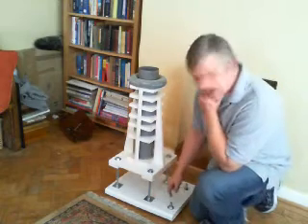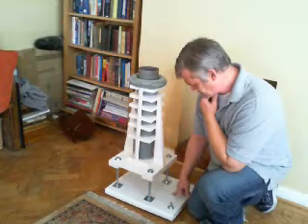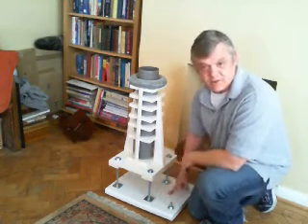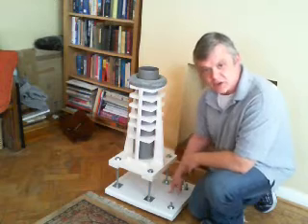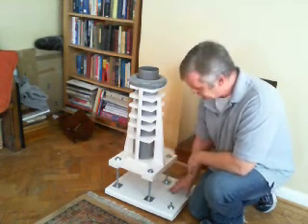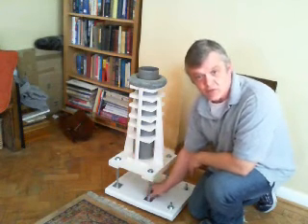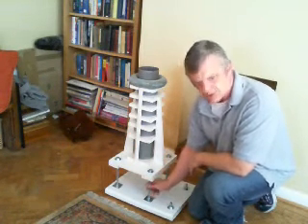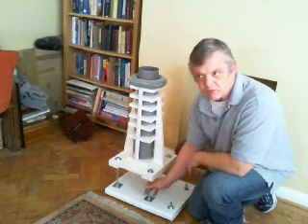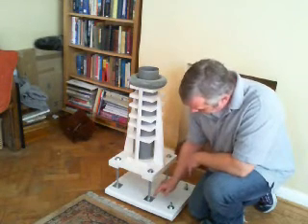The base unit is made from builders board — I only had builders board 175mm across, so I've joined two pieces, and underneath I used bracing pieces going that direction to thicken it up and give it a bit of stiffness. These are 45 centimeter long M12 rods. The reason we use M12 is stability — M10 could work, but M8 is going to be far too unstable.